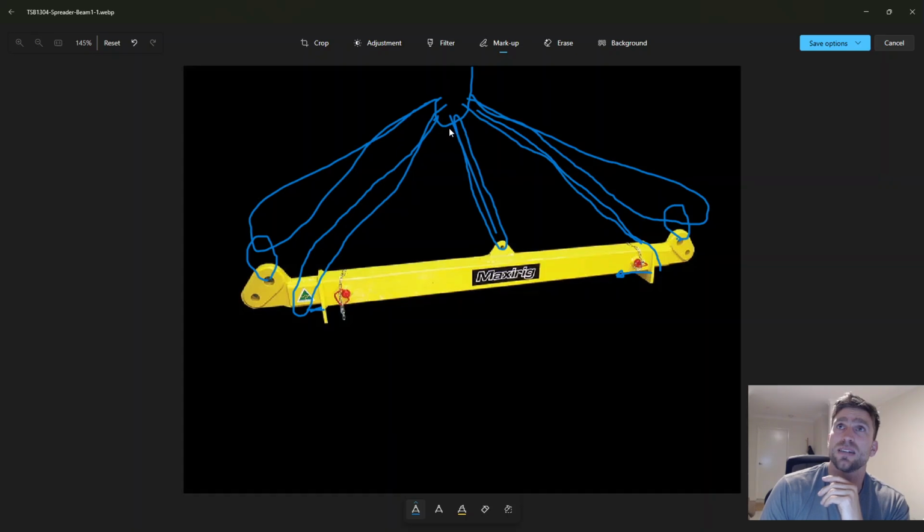You can even, if the spreader bar's not a new one with nice new paint, just choke the spreader bar there and there if it gets too hard. So those are several ways you can pick this up. If it's got huge shackles on it, you just basket through the shackle. Feed the chain through that shackle around the other side, back onto your chain ring, and back hook it. You can go just off the stinger there. That's so simple. If you've got a shackle, just a small little sling, you can basket around there so it hooks into the little stands here, so it can't slip in.